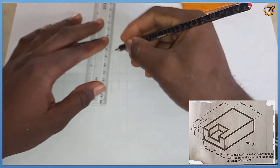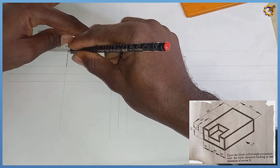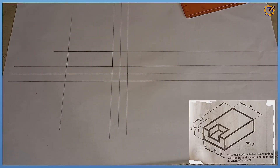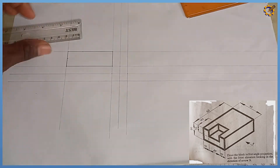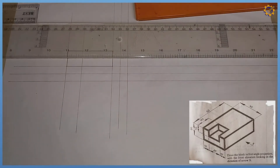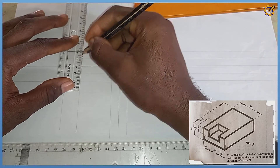I'm going to bring out my front view. This front view is not yet complete — looking at the object from the end view area, we have something like a slot or chamfer inwards. That slot needs to be visible in the front view as a hidden line. So from this area I'm measuring a mark of 10mm, and on this plane a mark of 20mm, then projecting them accordingly. Since they are hidden details, I'll represent them with hidden lines — thin short dashes.